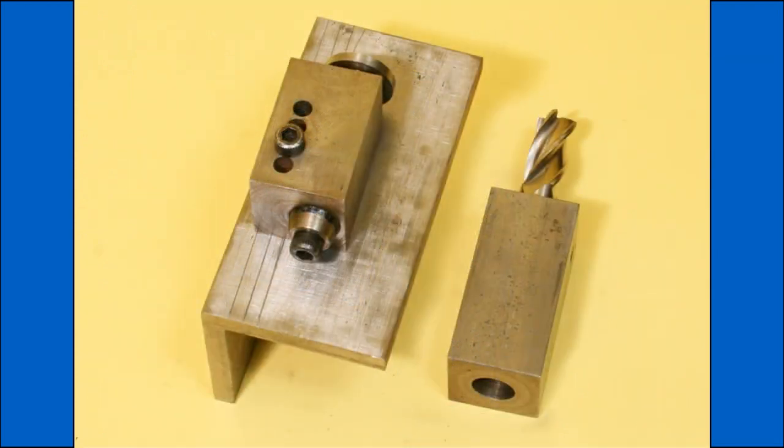Initially, let us consider how the fixture works. First, each cutting edge must be set horizontally or vertically in the cutter holder. The round disc seen at the far end of the device projects from the side and acts as a stop for the cutter holder, with the cap head screw moving the disc forward or backwards to control the amount being ground off. The lines we see on the table are a guide for setting the device to an angle to achieve the concave nature of the end of the cutter, this being essential.